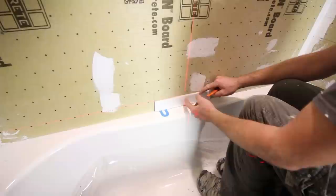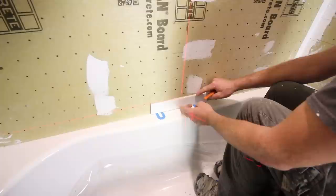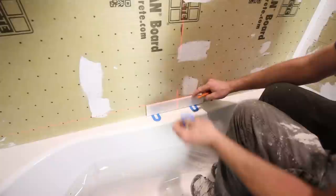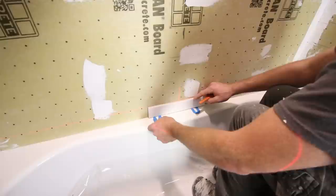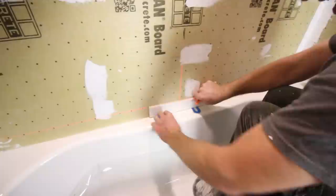The main reason for having a space is expansion and contraction — in cold and hot weather, the tile will actually expand and contract slightly. I like to use horseshoe shims; they're much easier than those rubber ones at the home stores, very consistent, and easy to shim up. If I were slightly off level, I can just add another one to get the height. Horseshoe shims are definitely very helpful, especially with subway tile.